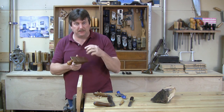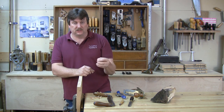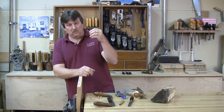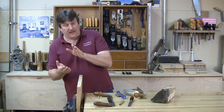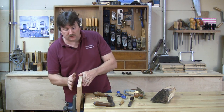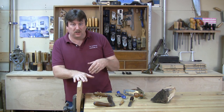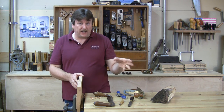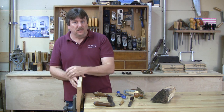That's really all that chisels, hand planes, knives, and a variety of other cutting tools do. They're designed to split those straws apart using what we know about the structure of the wood, which is that those straws are bound together stronger on their sides than they are on their ends, and that the vast majority of straws in this board are running end to end at a slight angle to the board, because we've imposed a flat surface onto a cone-shaped, asymmetrical, naturally occurring substance called a tree or a log.